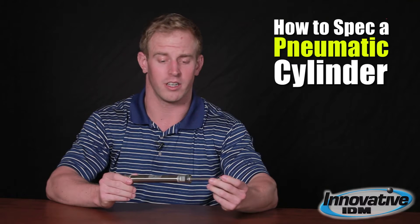I'd like to let everybody know that it isn't as hard as it might seem. There are a lot of tidbits of information that go into each and every cylinder, such as mounting — is it a clevis, double clevis, is it a tie rod, is it an aluminum body? There are a lot of different variations and specials, and customized cylinders. The OEM of the machine will specialize a cylinder, and it might be something as simple as a different type of metal in the rod.